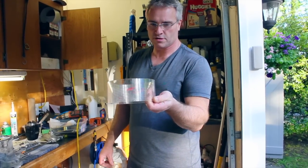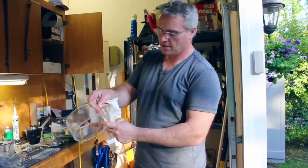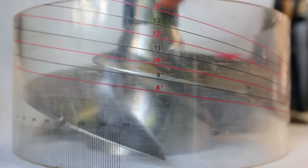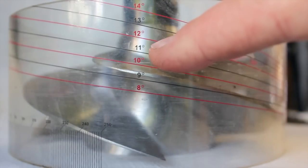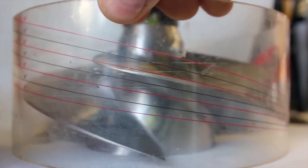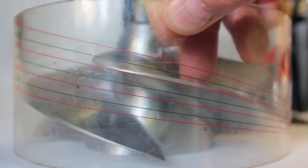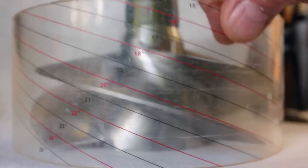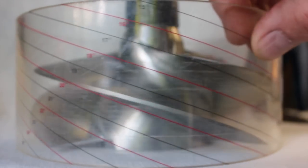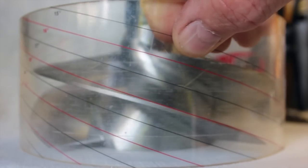This is a trailing edge gauge, and then another one for a leading edge. If you look at the number 12, 13 — this one's pitched at a 12 and a half leading edge, so it should be halfway between the red and the black. This is a trailing edge gauge: 18 is the red, follow that right down to here. It kind of lines up with the trailing edge of the impeller.